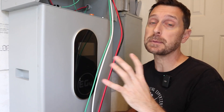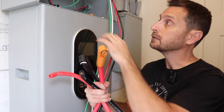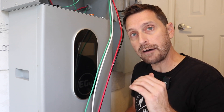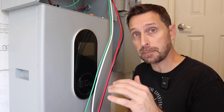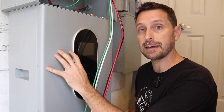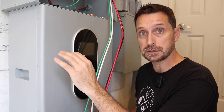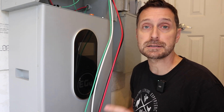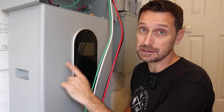What they've done with this battery is also made it a lot easier to connect to your inverters. There's a special type connector here which just snaps on to the lugs on the top of the battery. A huge advantage is that when you have multiple batteries, what can happen between the batteries and the BMSs is that their state of charge can start to drift from one another. I don't have data confirming this happens with multiple indoor wall mounts paralleled together, but from experience this happens all the time with many server rack style batteries — even if they have communications between the batteries and the inverter.